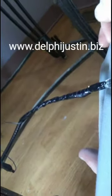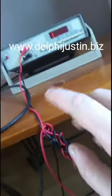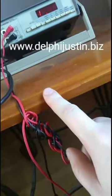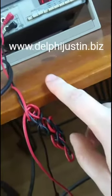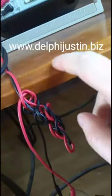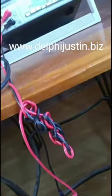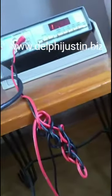Now, if it was 5 point something, you'd definitely know there's something wrong in this cord, because that means your middle resistor that goes between the output ground and input ground is shorted, and it's not using the resistance that's there in series. It's just going through your tip and using that. And that's what we want.